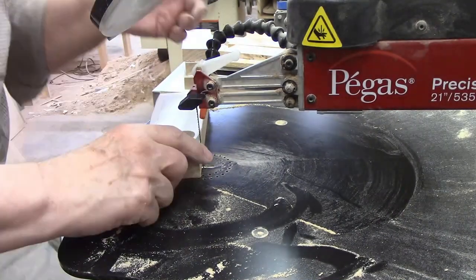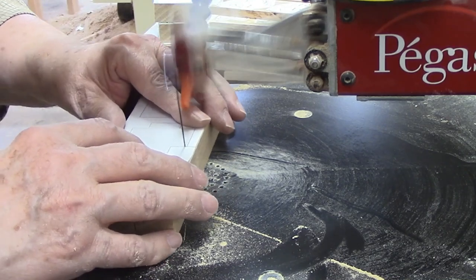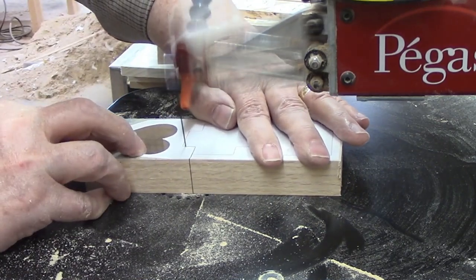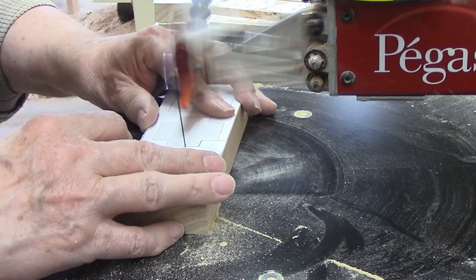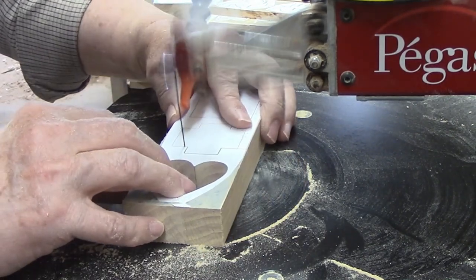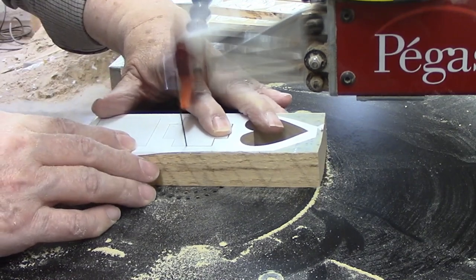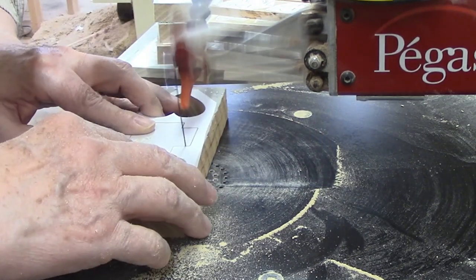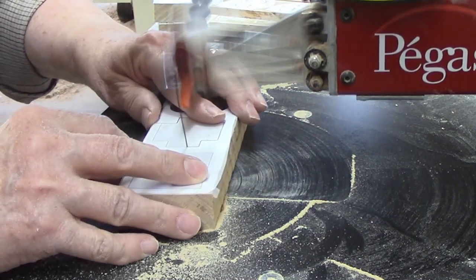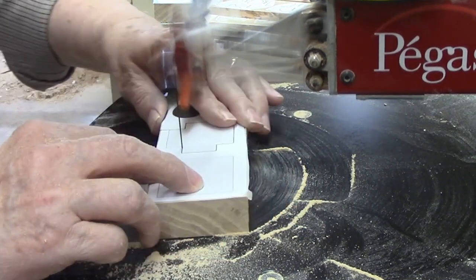I'm cutting the geometric shapes next, but I wanted to check the fit before getting too far. The heart shape fits easily, so I can confidently cut the rest. Per the plans, I'm cutting these from 1-inch thick stock — red oak. I had a long narrow strip of 6-quarter oak left from another project, planed it down to 1 inch thick, covered it with scroll saw tape, and attached the patterns. I switched to a number 9 Pegas modified geometry blade due to its thickness. A number 7 would cut too slowly, and a number 12 would make sharp turns difficult. Since cutting the frame on the outside of the lines ensured room to spare, I can make these cuts right on the line. I want the fit to be loose, but not sloppy.